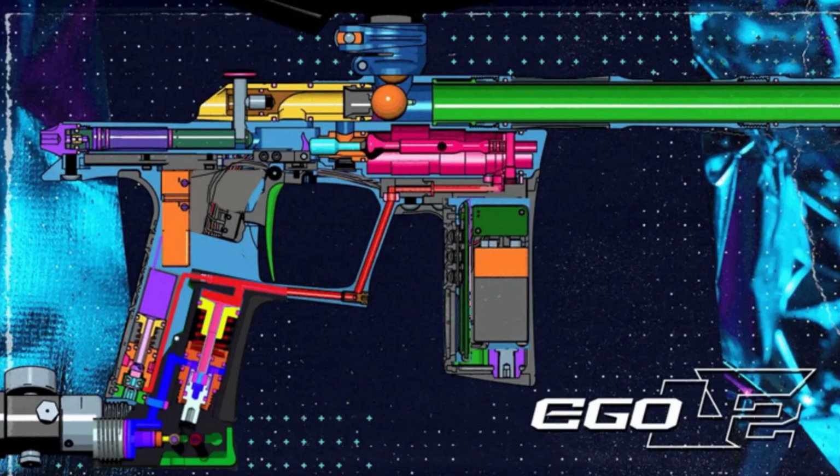And if you create this new module in the front foregrip of just electronics, you could actually create a common foregrip across the whole line of all the markers, which is what they had the intent of doing by modularizing the boards. Now, just imagine using the same foregrip across the Geos, the CS1s, the G-Techs, and the LV platform. I think that's a pretty good idea. You can isolate it. It's far easier to prevent ingress of water and paint and moisture. You can create a contained unit in that foregrip. So I thought that was a pretty nice solution to it.